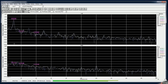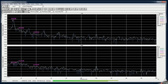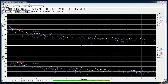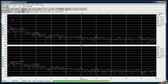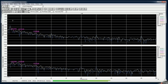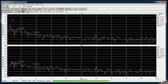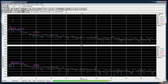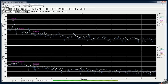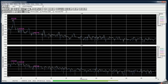A normal audio signal. However, I would hope that the signal at 5 hertz can really go through. And the reason why I'm looking at this low frequency such as 5 hertz is that I wanted to use this audio interface also for some seismic experiments that I had with geophones and stuff like that, but it's not going to work very well without modifications. Perhaps I can change the capacitors at the input so that the lower frequencies can go through as well.